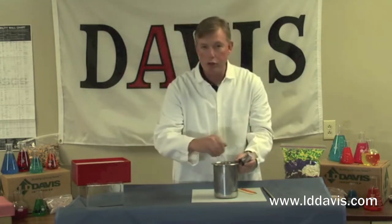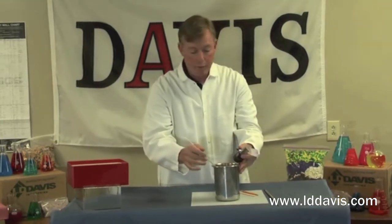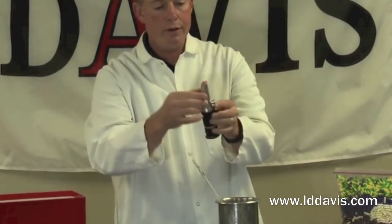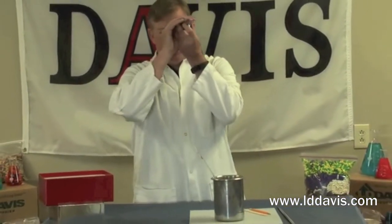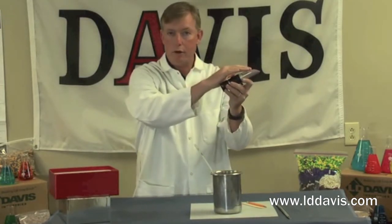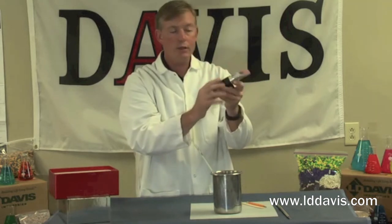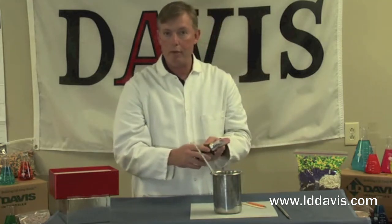What it simply does is it measures the actual solids of the adhesive. We have cake glue that's melted in this container here. We put the melted adhesive for the cake glue on top of the surface of this refractometer, press down the lid, and by compressing the adhesive, you can see what the solids are based on where the line is drawn with the numbers on the refractometer. This shows that the solids are around 55% for this typical cake glue — it's a little high for this application.